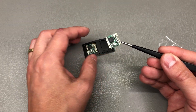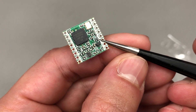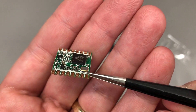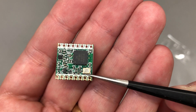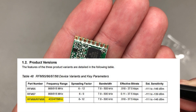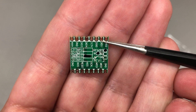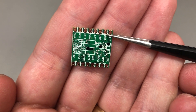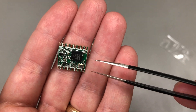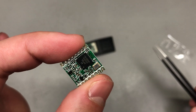Next up I have a pair of RFM95 LoRa modules — the popular LoRa modules from HopeRF, based on the SX1276 chipset. In this case the chip is custom marked as RF96 for these modules. What's a bit confusing is that I ordered the 868MHz variant, but according to the documentation the RFM96 marking belongs to the 433MHz band. On the back of the PCB it is clearly marked as 868MHz. I believe they're all based on the same chipset, just with different impedance matching networks for different frequencies. I don't plan to interface them to any particular system, so not a big deal.